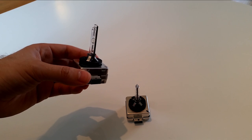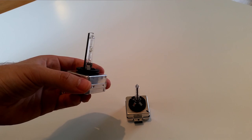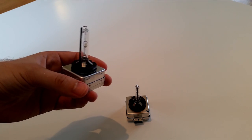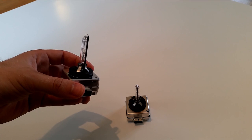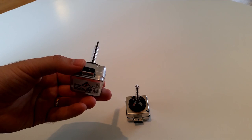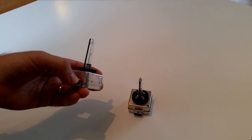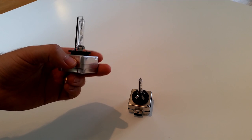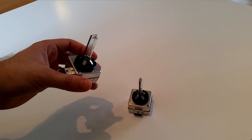So I hope this video was useful for you to spot fake Osram lamps. There are many fake Osrams on the market today, and unfortunately even honest sites that sell lamps can be fooled by a dishonest distributor — so you might not even know, and the seller might not even know, that the lamps are counterfeit. The Saab 9-5, which is the car I'm driving, is notoriously sensitive to bad xenon light bulbs, and I'm hoping I haven't destroyed the xenon system in the car yet.